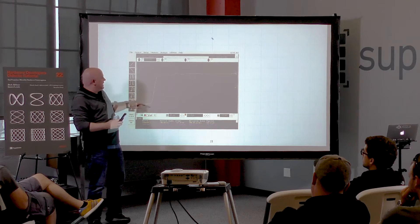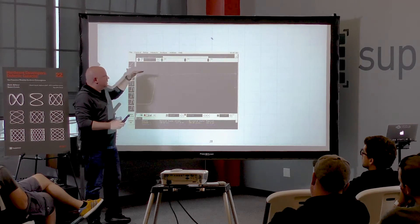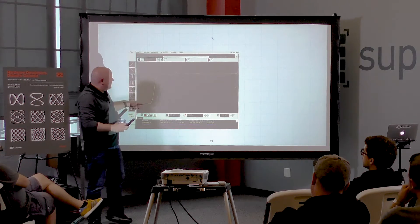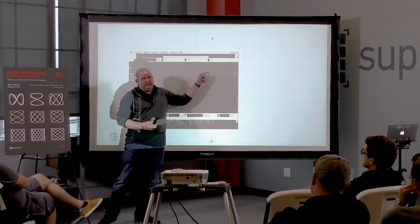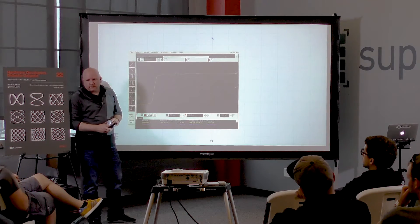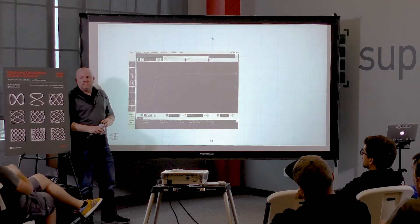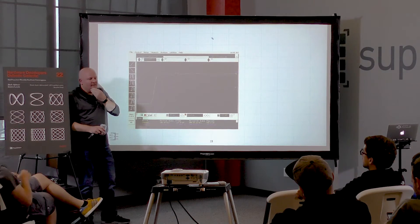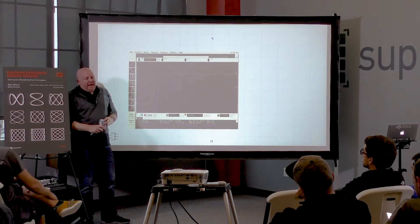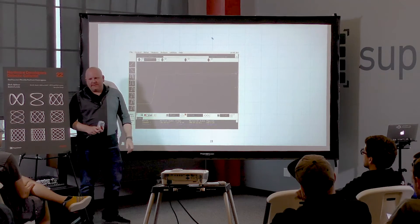If you go off the screen, you're going to cause problems — it's a general case. The speed of the signal also matters. It's pretty amazing how the analog front-end works: you can have a 10 millivolt range and accidentally put a 5-volt signal on it, and it doesn't destroy it — the amplifier just clips. Even before the attenuation stage, most scopes attenuate the signal anyway, so by the time the amplifier sees it, it's already a fraction of what it was.